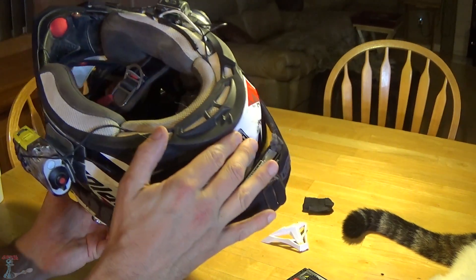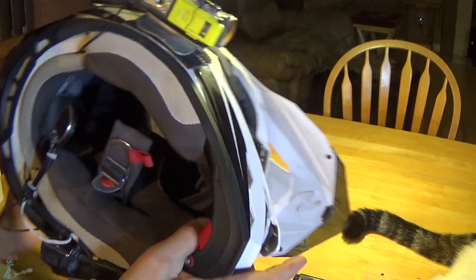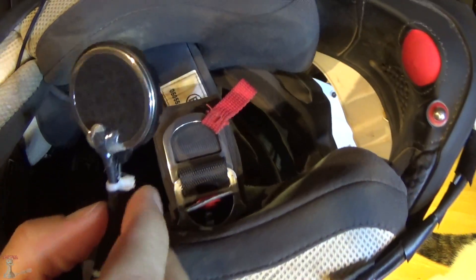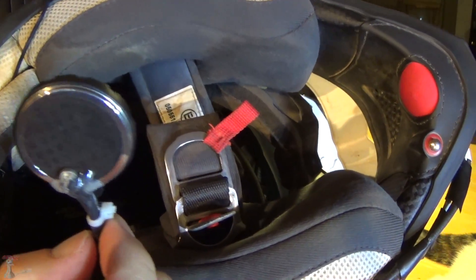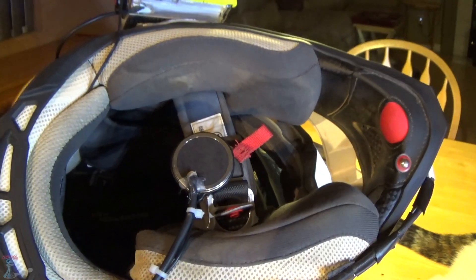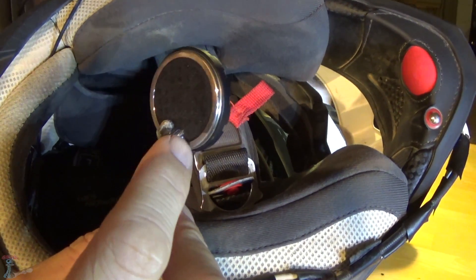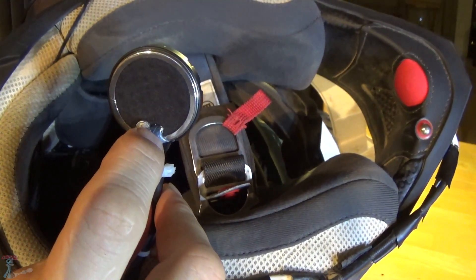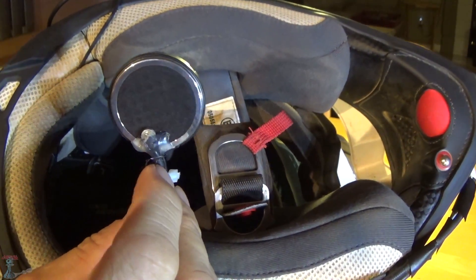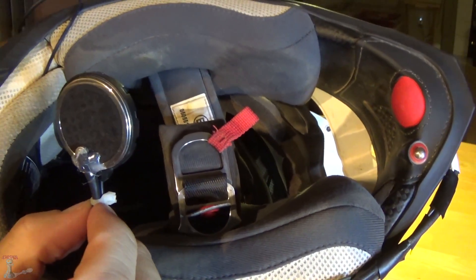Let me pull out the speaker and show you how it's attached. I don't really like pulling it out because I feel like it's fragile, but once it's in the helmet, protected by the pad and not moving, it's good. So this is the speaker, and then this is the little microphone, and I just put a little bit of hot glue over the top of it to protect the wires — they're soldered on there. Hot glue was the only way to attach this to the speaker so it doesn't move. It has to be pointing toward the speaker to pick up conversations. If it's right next to it but pointing up, even if it's touching it, it won't pick up the speaker. I did some tests and it's got to be right here. I ruined one of these speakers on my first attempt — but I tried this stuff, I ruined it, and now you guys can learn from my mistakes.